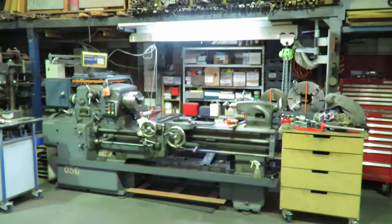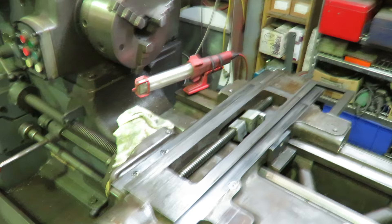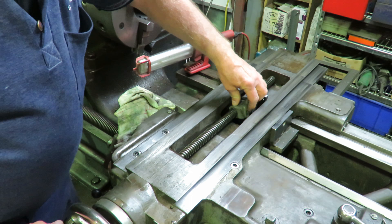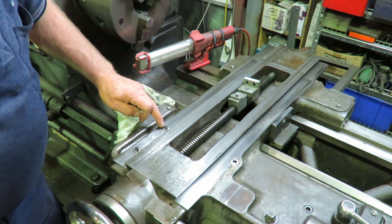Fred's got plenty of cubby holes around here — stacks of pretty stuff in his workshop as well. What we'll do is move over and have a look at the cross-slide saddle, and then we can have a look at some of its features. It's pretty sad — it's had a hell of a hard life, this lathe. What we found is the cross-slide sits on top of there with the gib to hold it. We found that it was touching on a few of these studs, so Fred's taken them out and machined them off and put them back in again.